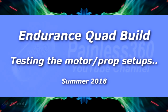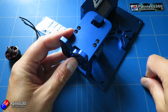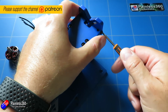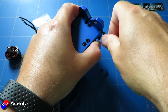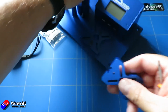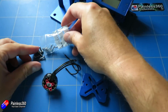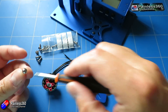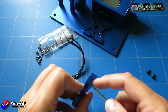Hello and welcome to the next video in the quad efficiency build. In this video we're actually going to get round and finally do the testing with the motors that I've got here to try. Now just a couple of caveats before we get into this. I'm looking at using these modern motors in a slightly unusual way. These lower KV motors are really designed to support things like 6S batteries, but I'm actually interested in building a quadcopter that will fly for longer than seven or eight minutes.